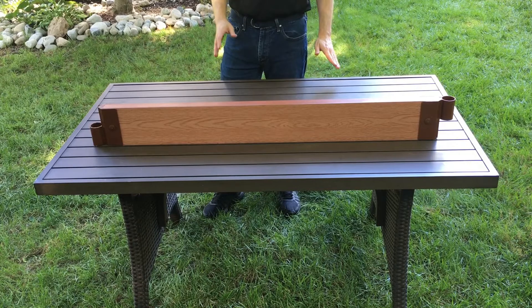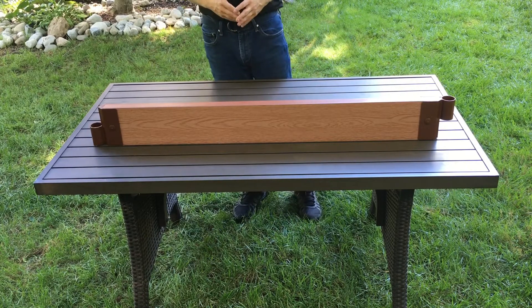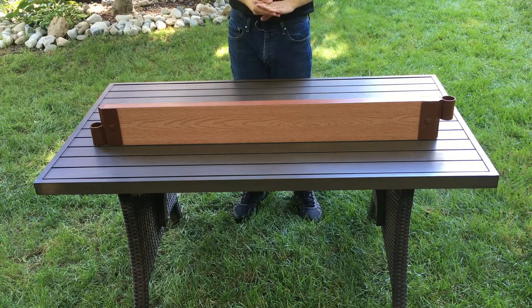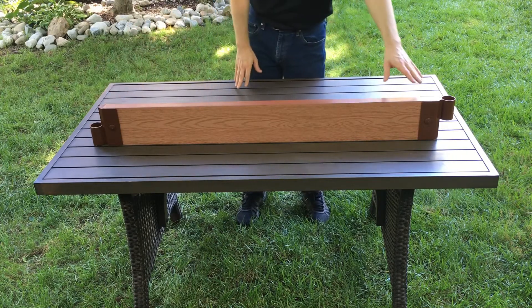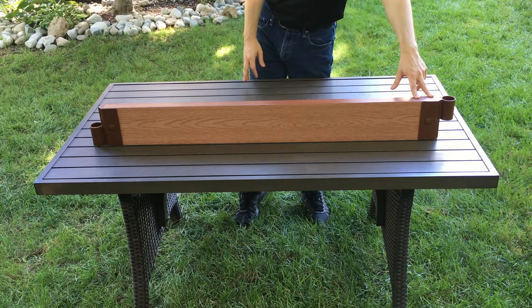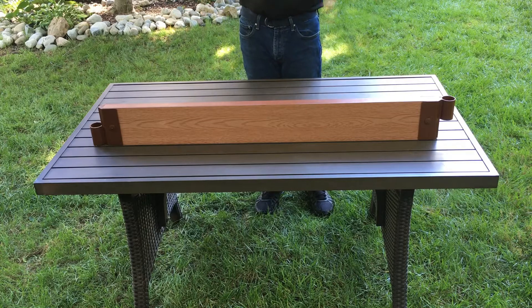When connecting the brackets to your boards for this design, make sure that all boards are connected with brackets in an alternating orientation. On this timber we see that this bracket is in the down position, while on the other end this bracket is in the upward position. Make sure that all boards are connected with brackets in this pattern.